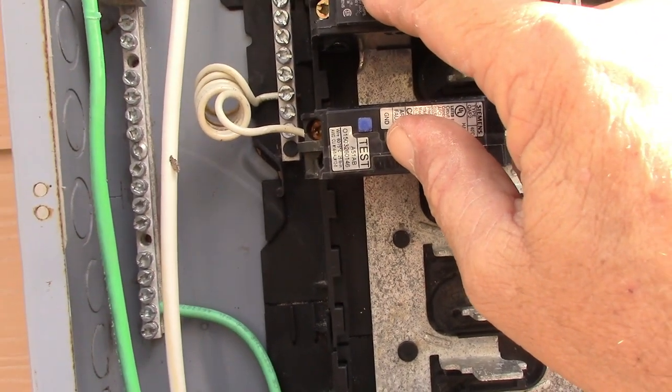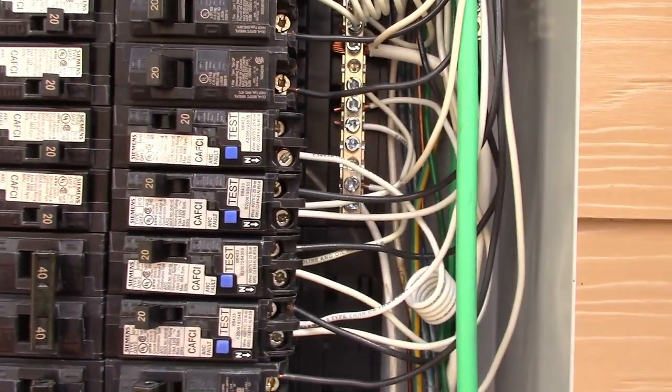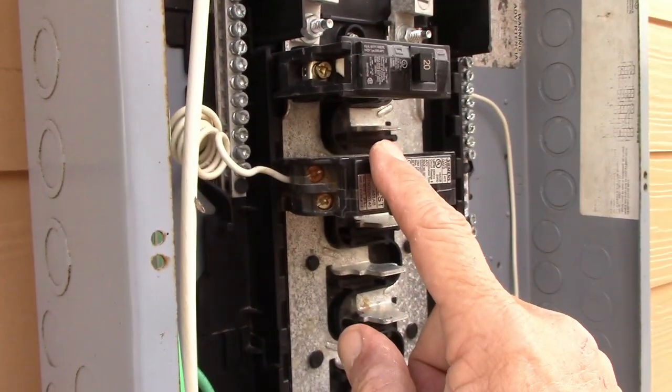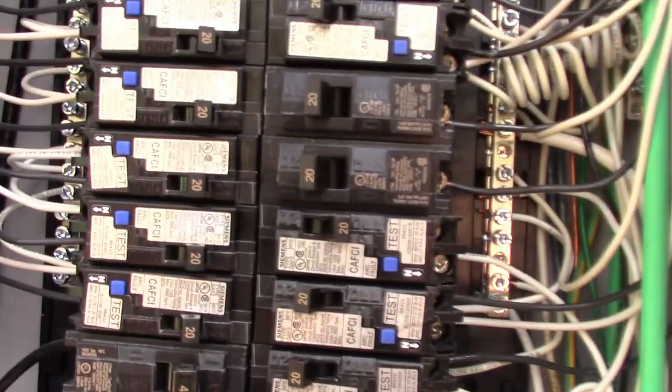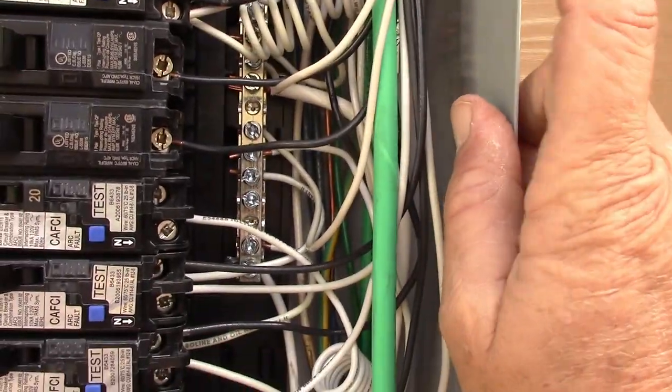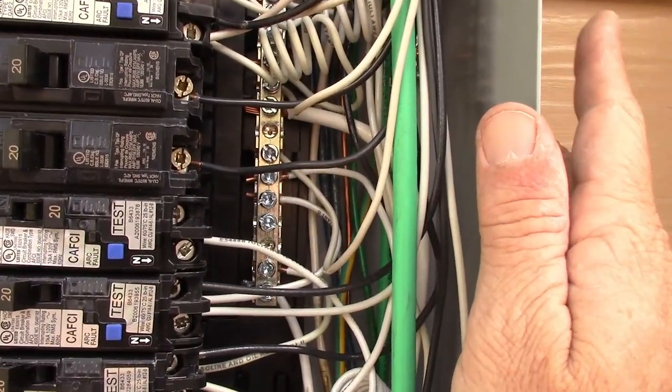So I extend the wire, pull it through the pipe into this panel, and connect it to the breaker. That is basically it. When you do this for a standard breaker, you do not have to transfer the neutrals — you can move just the hot wire from this breaker into the transfer panel and leave the neutral connected in the main panel. You don't need to move the neutrals into the transfer panel's neutral bar.